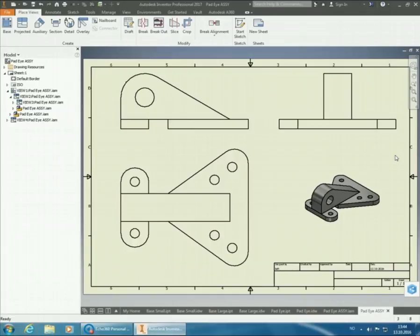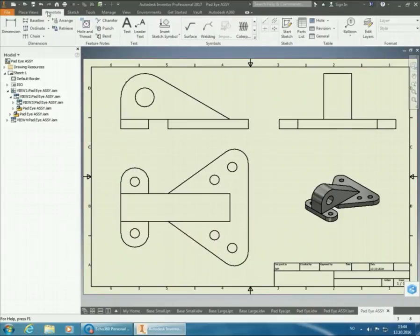That's a must to put in, because it's going to be difficult to put the distance from where the slope begins here to the end. That's going to be a very difficult one. So it's much easier to just give the gap between the plates. So we'll switch over to the annotate part of the toolbar. And we'll do regular dimension. And we'll set it between these two lines. That's going to give us the gap that is needed. And we need to put it to method 1B.